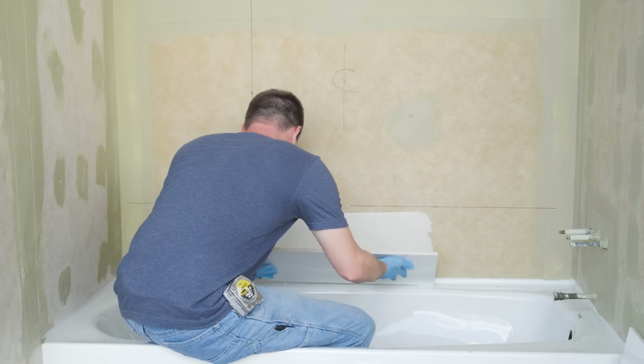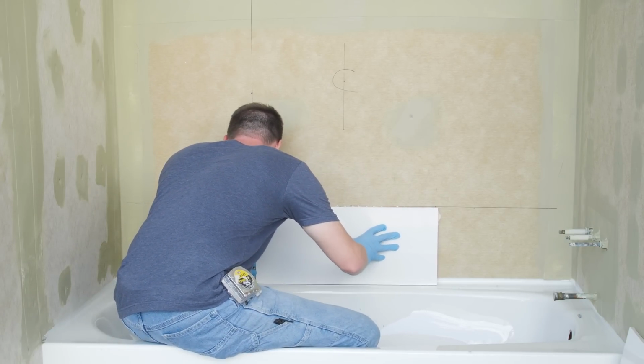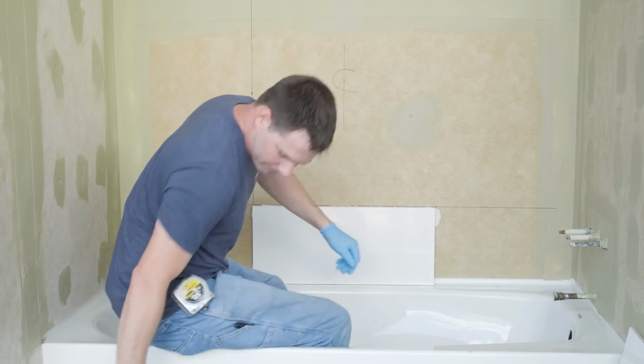After the thinset mortar is applied, press the tile on the wall and at the same time slide the tile from side to side. This action collapses the ridges and evacuates air between the comb ridges so your tile has maximum contact with the wall board.